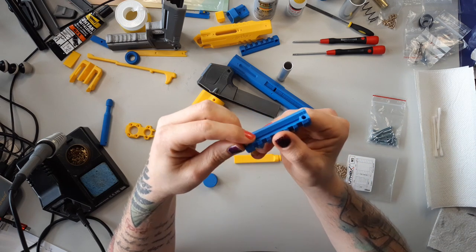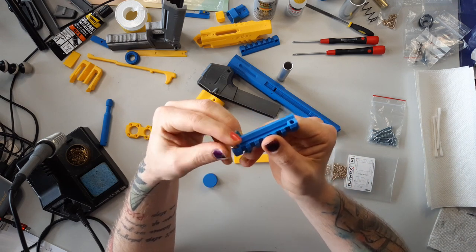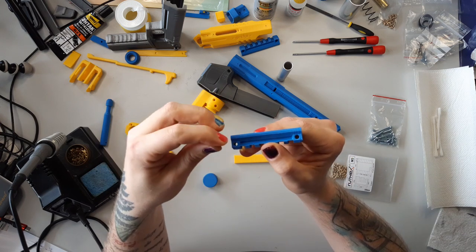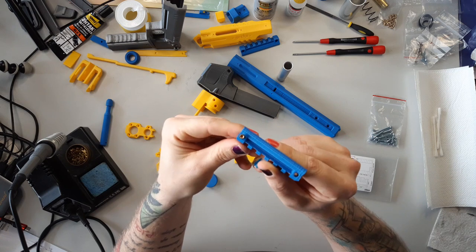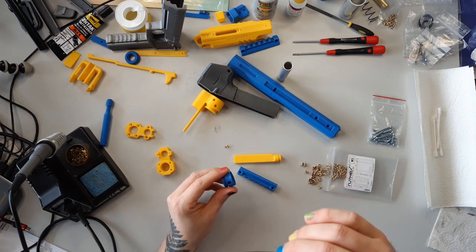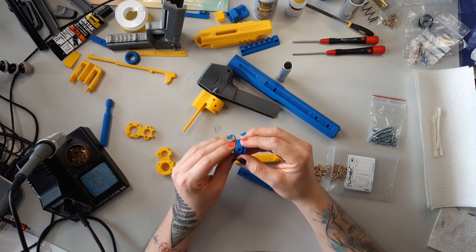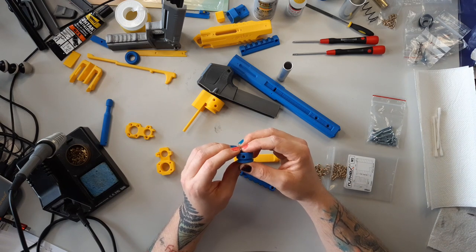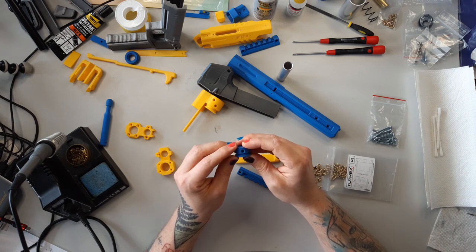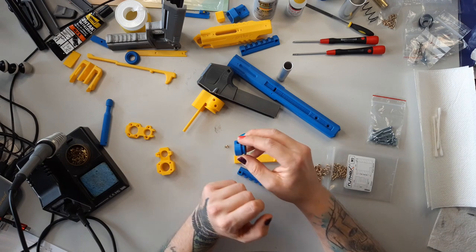If you find that in your print it's sort of tilted at an angle, then take it out and maybe take an X-Acto knife and clean out this hole. Because if they're printed correctly, they should sit in flush. That is important because otherwise you're not going to have them inserted straight. And in all honesty, you can only do so much correcting of a heat insert when it's in the part. Eventually, it'll become too loose and you have to reprint the part.